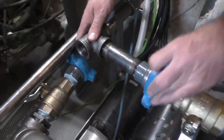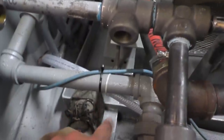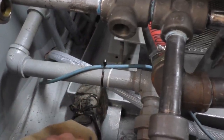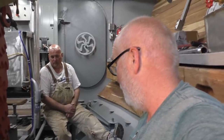And the last thing we got to do is once you drive a pump, you got to return that fluid back to the tank. So there's a tank line. He's pulling out today, but I'm getting every last minute until the ride shows up. And that is the return. And so see, it comes from the rear and from the front. So I've got to tie it into this thing down here. And we're also going to put it here because this is the high pressure. That's the return to tank. We've got to put a relief valve here that when the system reaches its max pressure, it'll open up and allow the fluid to go down into the return to tank. And it ends up going into here and it gets filtered through the Wix filter before it returns to the tank. And there's lots of fittings and short pieces of pipe, all gets cut and threaded, so we got a lot of work done. And I really appreciate it.